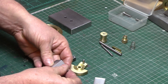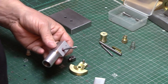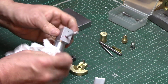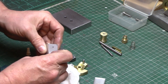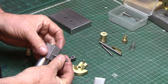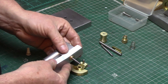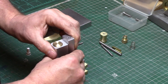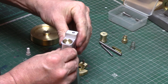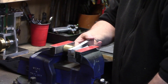Some locking compound is added to the threaded hole and the shaft, then this is reinserted and the excess adhesive cleaned off. This can now be reinserted back into the column and the thread loosened so that the cylinder and port face now sit flush with each other. This is then placed in the vise using a spacer over the shaft and gently pinched up to ensure squareness, and then allowed to set for a couple of hours.